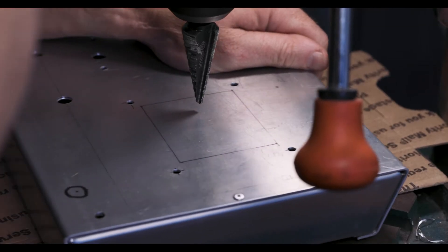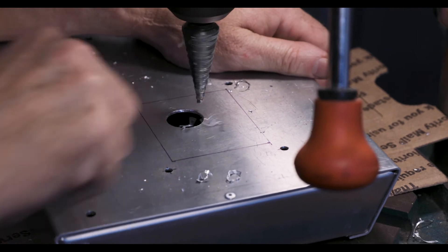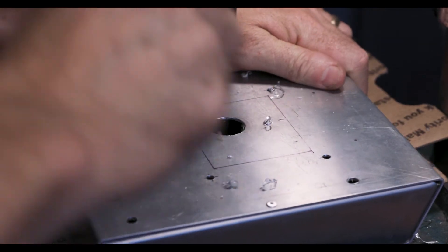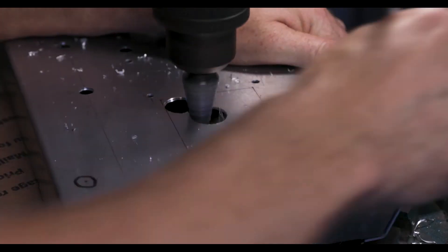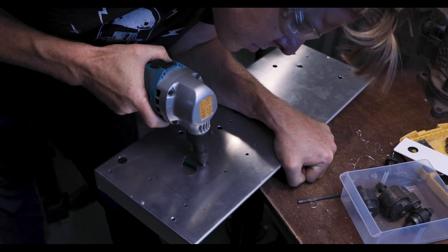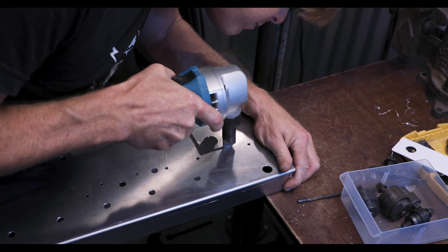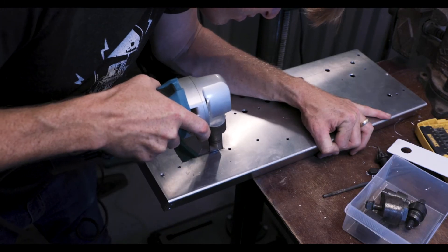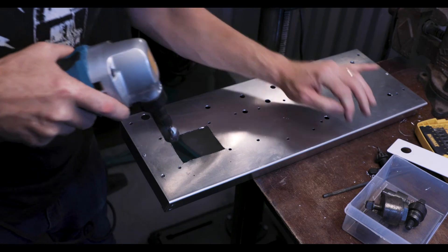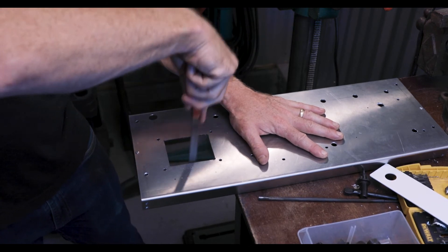Some transformers just affix to a chassis with pass-through holes super easily. But often your power transformer is actually going to need to be mounted with a larger hole for all the windings to fit inside. There are companies that make motorized steel nibblers, and you'll see I'll use one here. I drill my holes for the securing bolts, then drill oversized holes with a step drill bit so I can get the chassis nibbler in there and quickly zip through and cut out the square I need. I also have a flat file on hand so I can file everything straight and roll those edges to deburr them, because you don't want sharp edges digging into the wire.